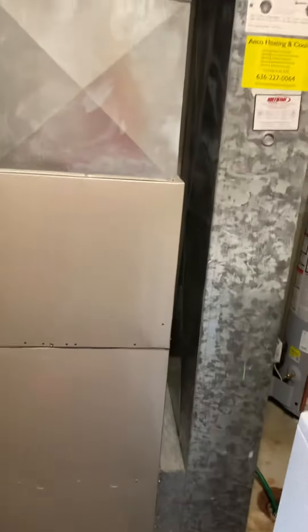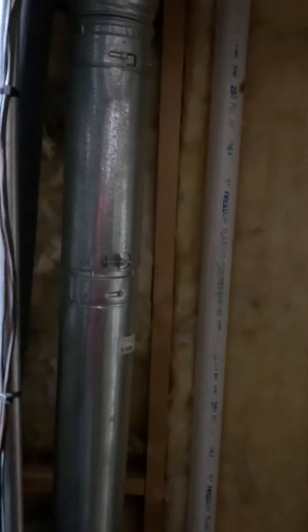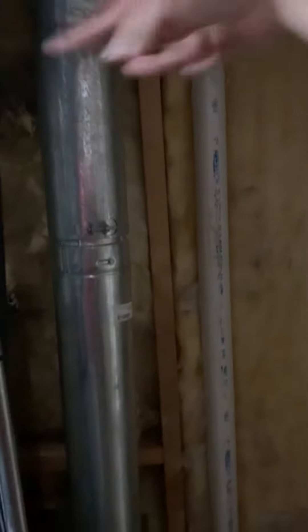Like I said, 180 — turn those around. Gas piping, I think we probably just come right in between the two. Electrical the same way. Flue piping — they've got B vent here and it's not needed; we just go single wall, a five-to-four reducer, and come right through there as well.